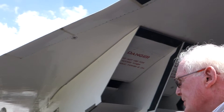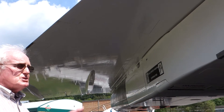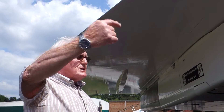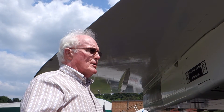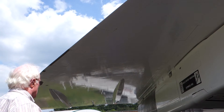Look at the leading edge of this wing — it deals with all attitude of this aircraft and speeds. As the aircraft changes attitude, so does the lift on this wing. At low speeds you are at 13 degrees, creating a vortex over the top of the wing which speeds the air up immensely, thus reducing the pressure on the top of the wing, so we get lift.